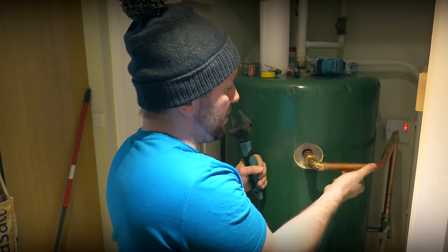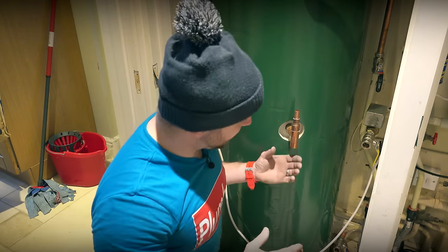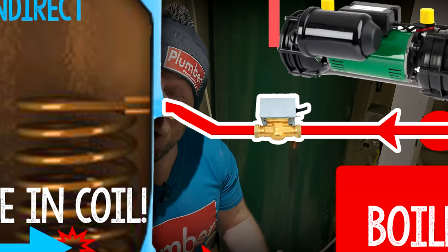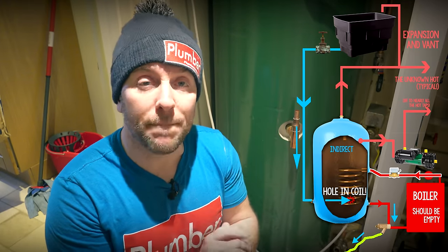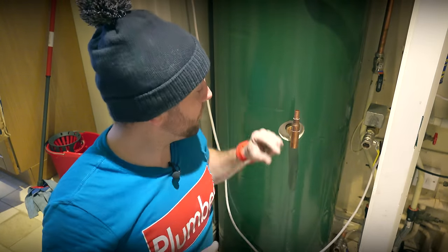Just slackening this nut off here, and as ever, a little bit of jointing compound on that nut and olive. I've got this little bit done in here now, and we've tested — really impressed, there's no leaks at all. I put more solder in there than usual because it's a new flux I haven't used much, but really impressed with the nice clean solders. Now we're going to pipe up the flow from our heating system S-Plan. We're putting a little T-piece in here, and then we're going to put our automatic air vent on just here. Because I've put two lever valves on the flow and return to the coil already, if there's a problem with the air vent we can just knock those two off and the air vent will easily be changed. Then we'll get down low and do the return as well.